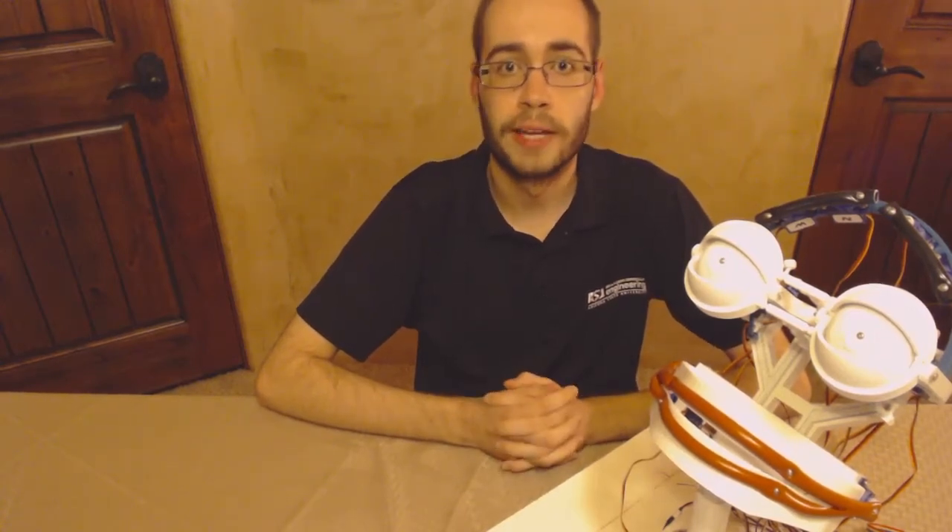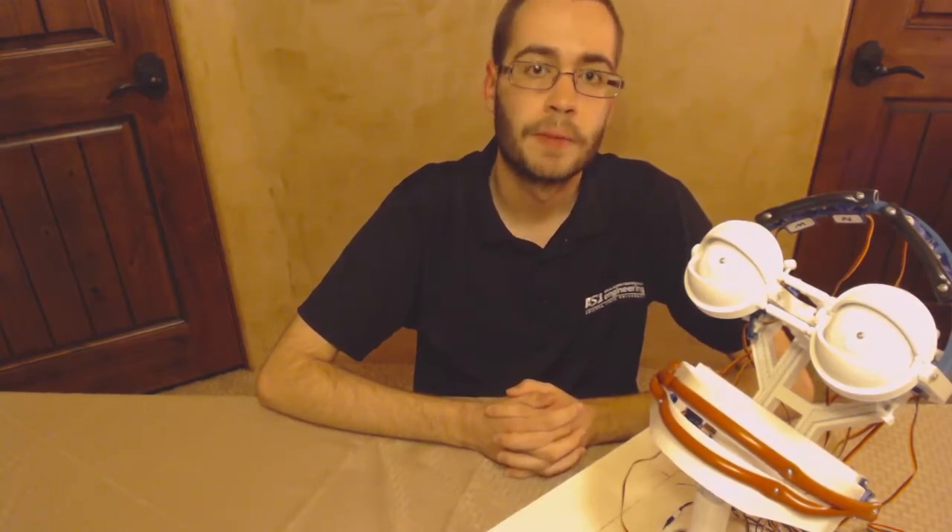Hi, my name is Ben Rathke, and I worked on Professor Sodeman's robot head project for my honors thesis, which started in the fall of 2017. Along with a friend of mine, Gerardo Rivera, we were tasked with redesigning some of the electrical characteristics of the robot, including making a PCB that could operate all the robot's servo motors, as well as have a 4x4 keypad which could run some of the existing PSOC C code functions that were already written, in addition to having a joystick which a user could use to control some of the robot's movements.